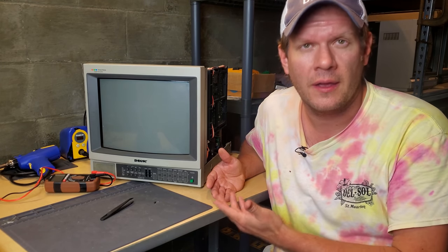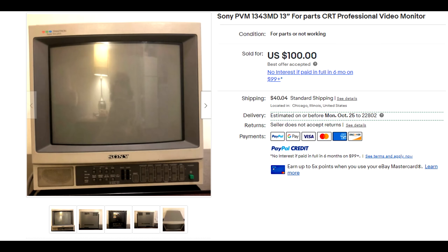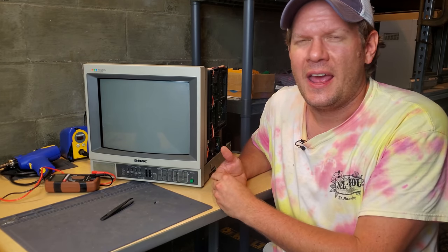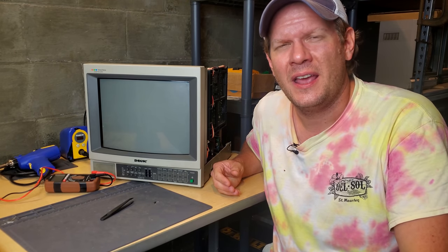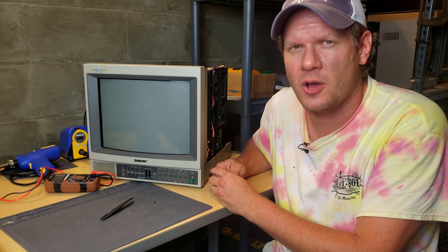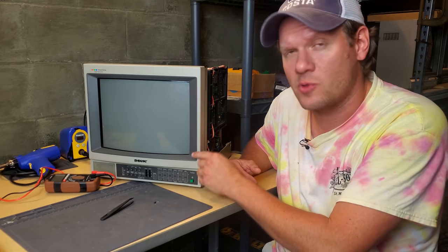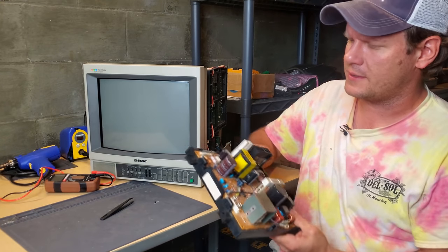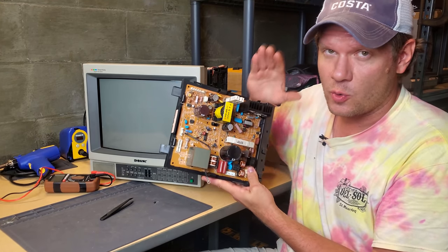And of course there's a catch with that, because this monitor should cost more than that if it was working. I read through the advertisement, and what really struck me was the way it was listed - it was listed as having been working, and then all of a sudden one day it just stopped. It looked like it was in pretty decent condition from a physical standpoint. I've worked on one of these before, and I've shown you where there are fuses on the power supply that do tend to blow. So today what we're going to do is check this fuse, and to get things started I want to go ahead and show you this PVM's actual power supply.